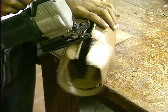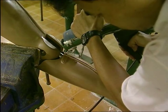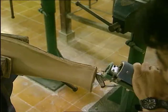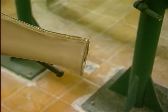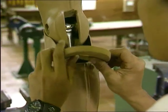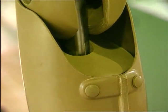The upper part of the calf is now cut to its final shape. The ICRC has developed an extrusion welding gun which melts the polypropylene at the right temperature without burning it, so the seam becomes as strong as the rest of the shell. A ring of EVA foam is added to keep the calf in place, and EVA foam may also be used on the shell to protect clothing from abrasion.